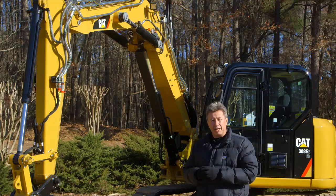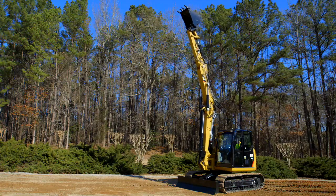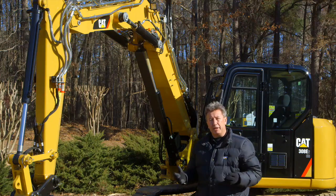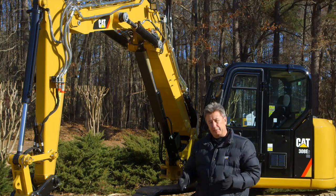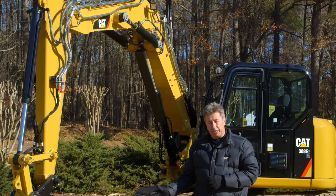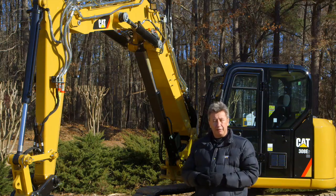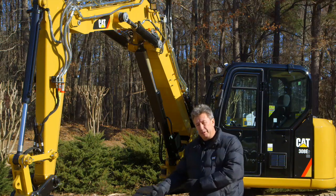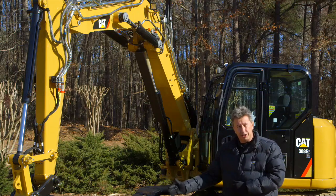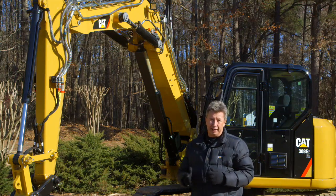If you're working in tunneling, you can reach a lot higher than what you can on a standard boom because you can straighten it out. When it comes to mowing a verge, you can keep the machine in a single lane, put the mower right next to the edge of the machine and mow that verge, then slowly reach out further. With a standard boom machine, you'd have to be further away from that verge to start mowing, and that way you're possibly taking up a lane or a lane and a half.